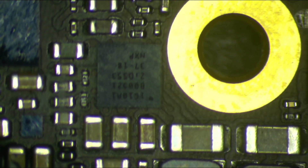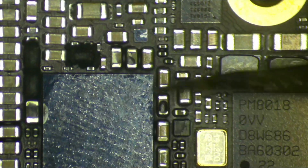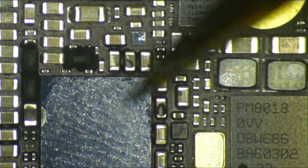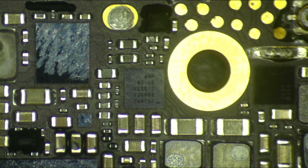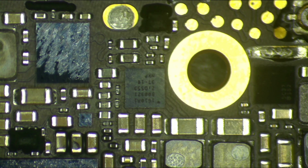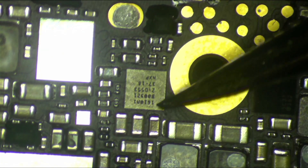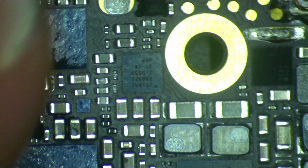We're going to come down. Before I do anything, I just like to be aware of what's on the board and where. We've got underfill on this chip just here, so if I smash heat coming in from this direction to remove this chip, we're going to spread more heat than necessary over here. But if I come in from this direction, we're going to be all right. You can use a coin or Kapton tape to cover the area — I've seen other repairers do it, but I don't get into it. What I do instead: we can see this little marker here — that's our A1 ball, which is the orientation of the chip. We need to remember that so when we put down the chip, we've got it correct.